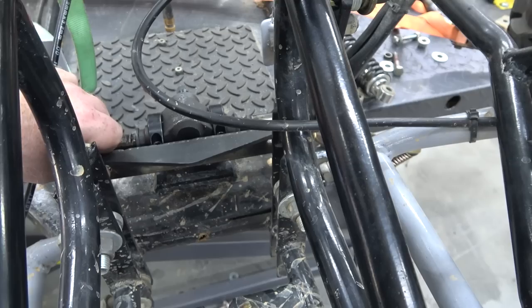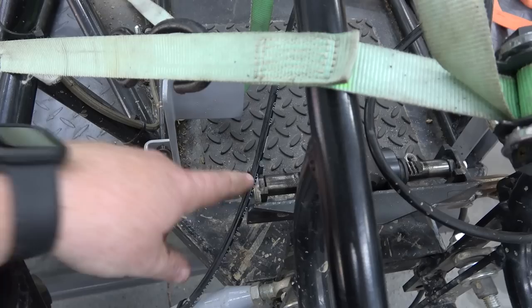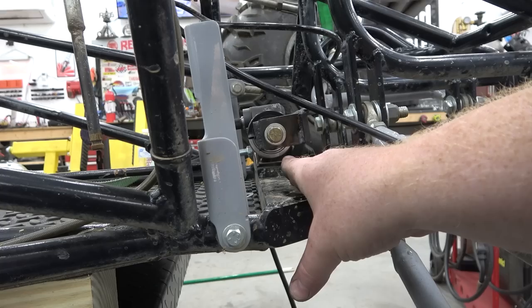I built that same thing before, but I just reinforced it with this top plate, and then I welded on nuts on each side and two axle keys that basically keeps it from rotating the rack. This rack bracket can never rotate side to side. And then we also got these lock collars, just like I was going to do on Gravy Bones, clamped around it, and we're going to build up steel to the bottom of them. It's really hard to see, but there's a gap under there. We're just going to build up steel. We'll grab a scrap piece of steel and lay under there, and I'll just bridge it and weld it in.